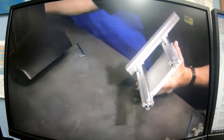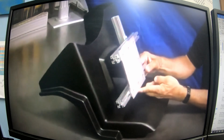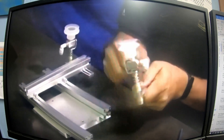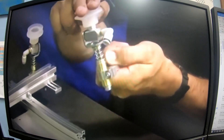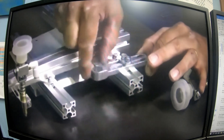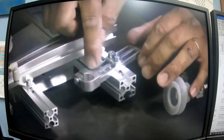Before you start adding components, you want to check the position of the profile in relation to the tool. With this particular tool, we will add three vacuum cups. This type of vacuum cup arm is spring loaded, which allows the cup to approach the part straight on, even though the part is at an angle — the cup will adjust to the position of the part. This type of clamp is adjustable along the length of the profile, the distance away from the profile, and the angle of rotation.